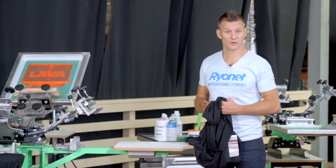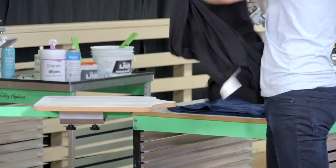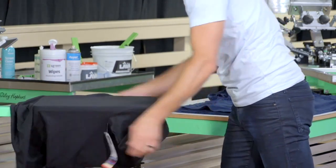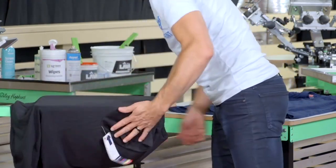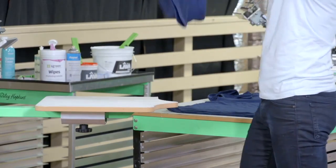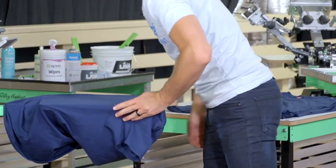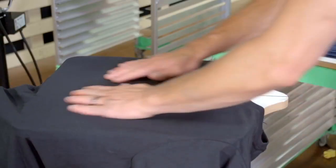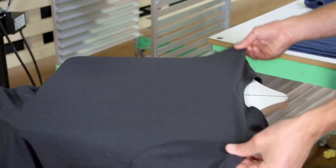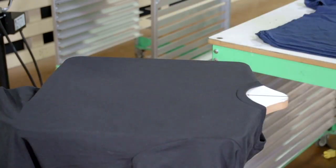The key to effectively loading a shirt is to keep it open so it doesn't get stuck when you put it on the platen. Depending on how many shirts you're printing, stack them on a cart near the press for easy access — I like to stack mine front up, as it's easier to slide straight onto the platen. Put the shirt all the way to the back of the platen, then pick up the sleeves at the corners and lift the shirt so it moves all at once. Once it reaches the neckline, let it drop back to the platen. If you're unsure of the centerlines, take the two sleeves and move them toward the center to see how evenly they match up. This takes practice, and I recommend stacking and loading shirts for a few hours to get comfortable with it.